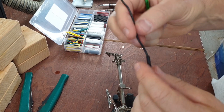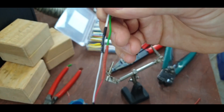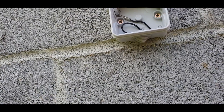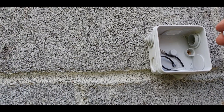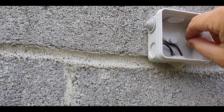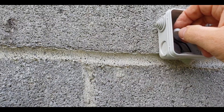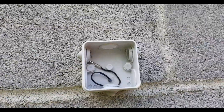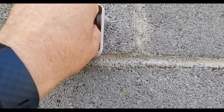Hopefully the different sizes should act as packers. That's what we're aiming for - now I'm going to heat shrink that and then I've got to do the same on the other end of the cable near the display. I'll put some silicone in the hole around the back of this box so we don't get any muck in there, pop the little thick covers in, and then put the lid on.